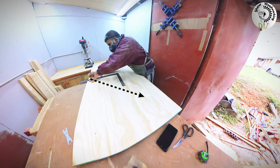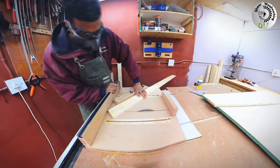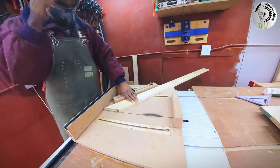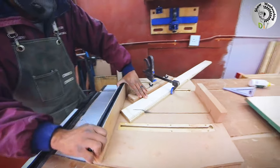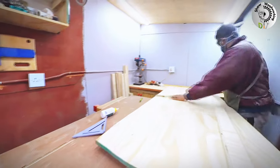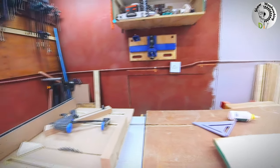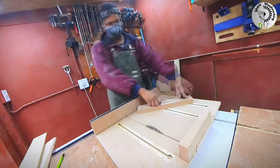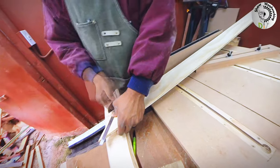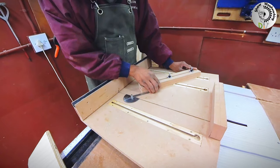I wanted the boards to start from the center point to the corner of the doors. I used my cross cut sled to cut up the first pieces to 45 degrees on one side each. Then we go back to our panel to mark up the pieces to the exact angle needed to make sure the pieces go from the center to the corner of the panel. I got this angle from those markings, then I set up my miter gauge on my cross cut sled to this new angle, which I used for the rest of the center diamond pieces.